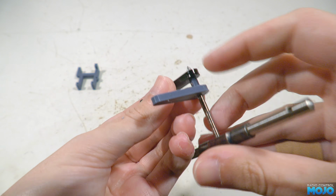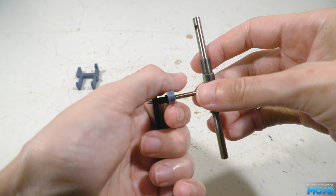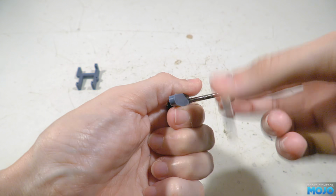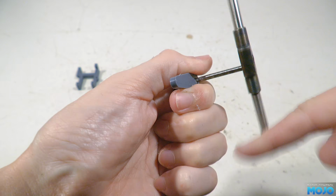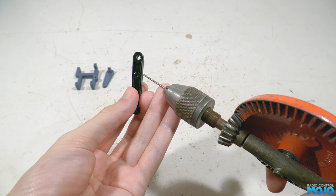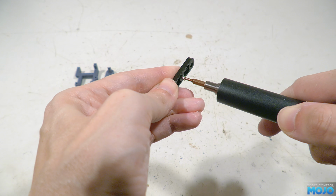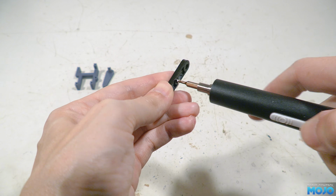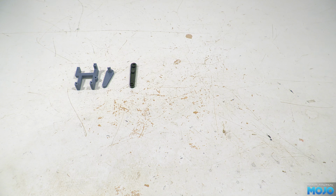The idea is we're going to get a thread inside the key and the lever, so when we fit the screw it'll spin straight in. Then we whip the tap out and very carefully separate the follower and the lever. The lever then needs the hole for the ball drilling out to 1.5mm. Then, just like the servo mounting holes, we spin an M2 screw in and take it out to form a thread. Okay, now for the servo.